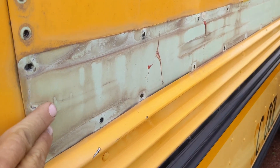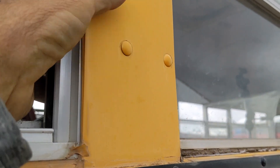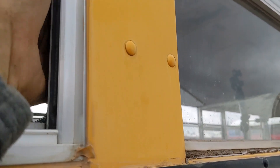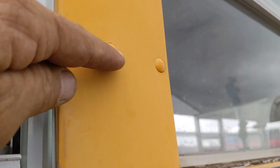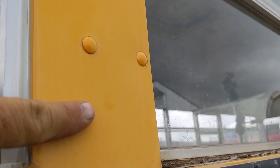The technique I showed you works fine when you have access to the inside. But what if you don't? These rivets are inside a column and I can't easily get in there — even after taking the interior skin off, it's hard to get in with a grinding wheel. But this piece of metal is going to be replaced, so it's sacrificial. In that case I'll just take the grinder and grind the heads off without worrying about marring it.